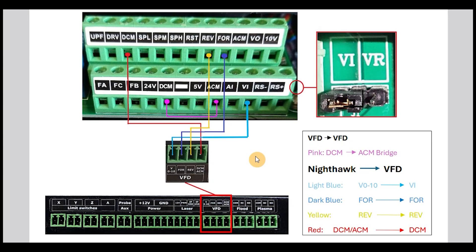If you've tried the standard DCM/ACM wiring, removed the bridge, and moved it to the top terminals and still have issues, the next step is to check your VFD settings. Many people ask if it could be a Nighthawk problem — it has never actually been the case; it's always been a wiring or settings issue with the VFD. Unfortunately, these VFDs have over 250 settings and values can vary from unit to unit straight out of the factory.